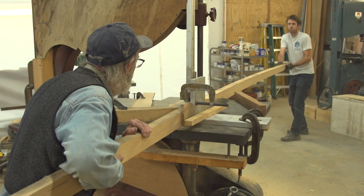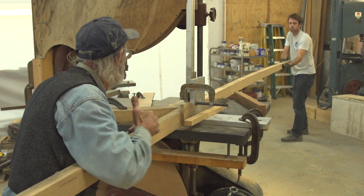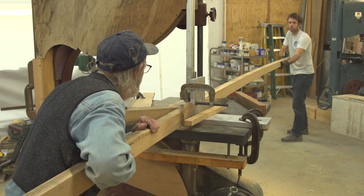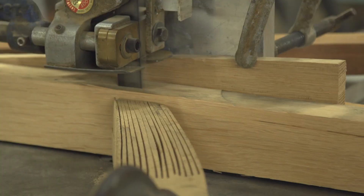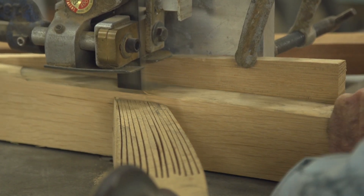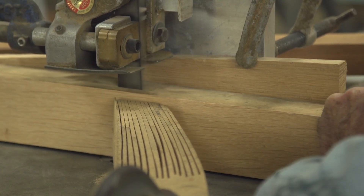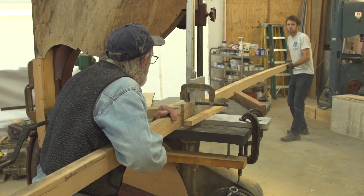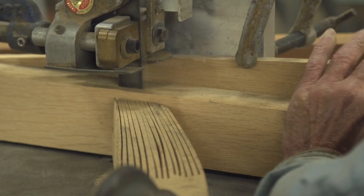The pieces we've got are a little bit too thick, and I wouldn't want to just plane them down and waste all that material. I'd rather just re-saw on the bandsaw because this is my favorite tool and it cuts beautiful. If I can save an eighth of an inch by cutting that piece off, I want it — we don't waste it, we re-saw it and hang on to it. We saw it with the curvature down on the ends because it wants to stay that way as you rip it. If you put the curvature the other way, it wants to topple over on you while you're trying to handle it.